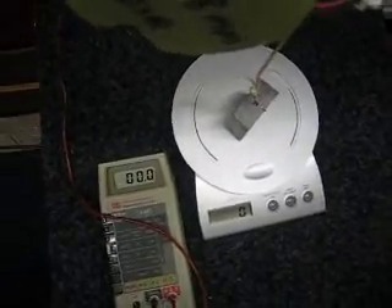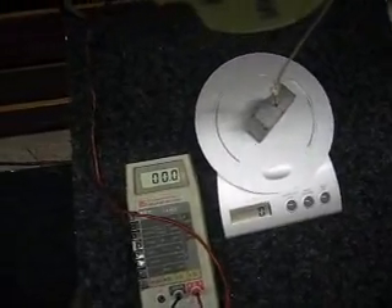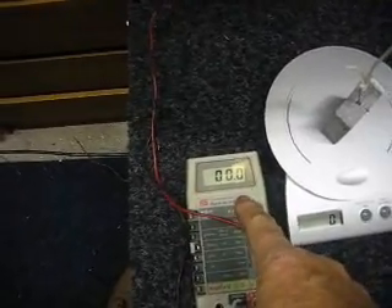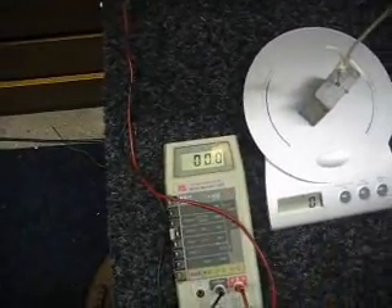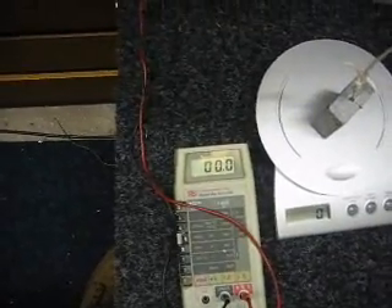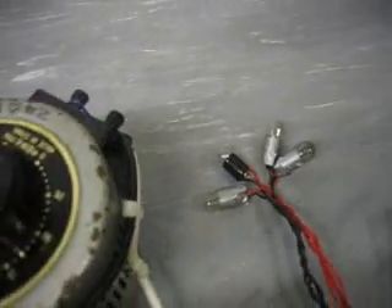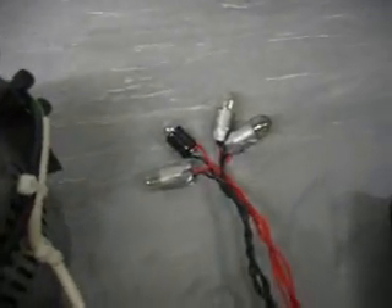Please don't tell my wife I'm using her kitchen scales. I've got my voltmeter, and I know that when the voltmeter reaches 13.5 volts and that 13.5 volts is being fed into these four lamps, that is equal to 30 watts — which is what I was getting from my Stirling cycle engine.